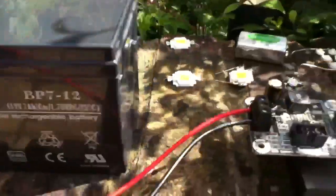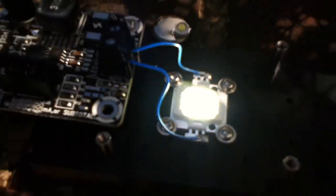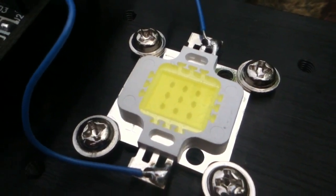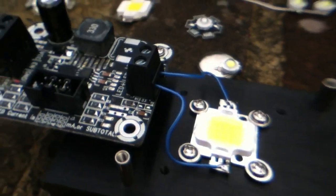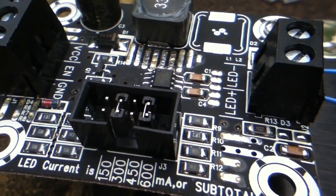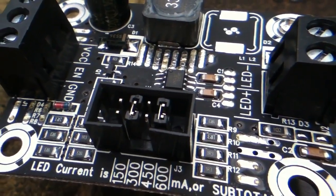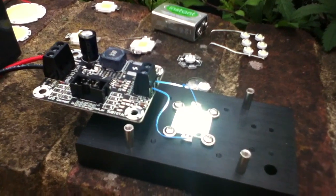Power is connected through the regulator and there's the LED running at full brightness. Now here's the 10 watt LED bolted down onto the heat sink. Connected up to the LED driver board — I've re-linked it because a listing for a 10 watt LED said 800 to 900 milliamps, so I'm going for 900. I've put in the 600 and the 300 milliamp links. And there's the 10 watt LED running flat out.